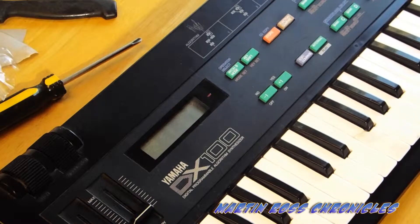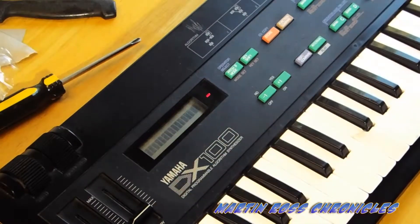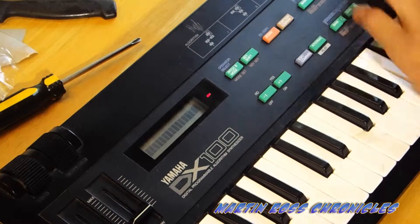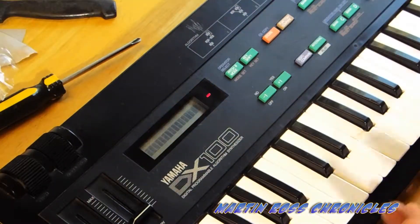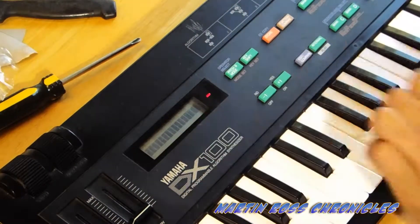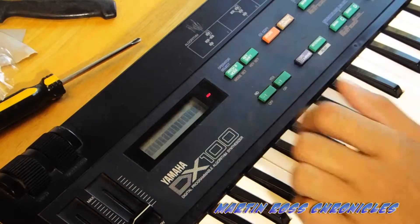If you're like me and your DX100 comes into block mode, and you can't see anything that you've programmed in your DX100, you can't touch any of the buttons and it doesn't change — don't worry, it doesn't mean it's over. What this means is that there's a battery voltage issue and it can't power up this screen.